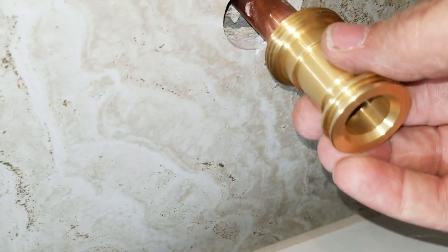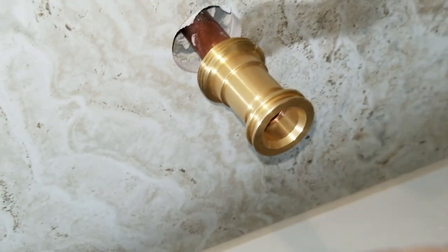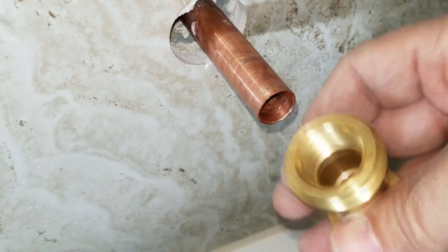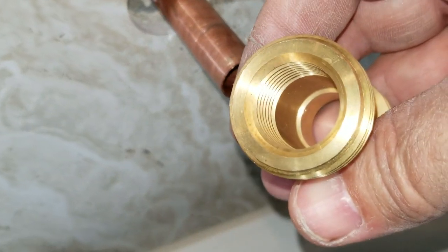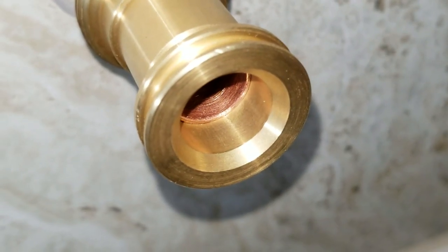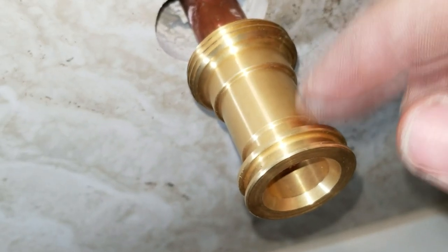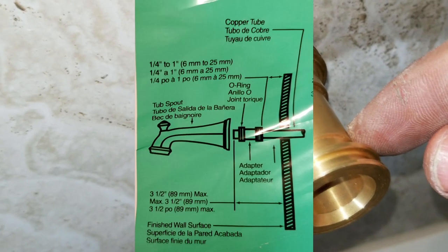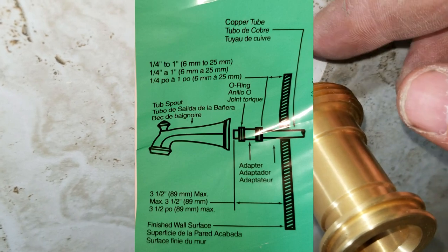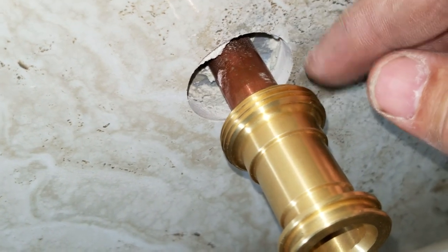The instructions show that you put this on like a collar and that the tube continues on and pokes out, and after you solder it in place they tell you to cut the tube off. The only problem is that is not how this part works in real life. Because if you look back in there, you can see there's a stop, and the pipe doesn't come all the way through — it stops right there inside. So this line on the outside is where the pipe ends. That's how we figured out how to cut it to leave us with the threads between a quarter of an inch and one and a quarter inches off the wall.